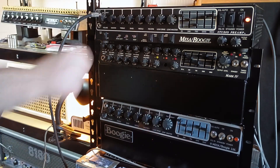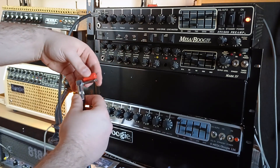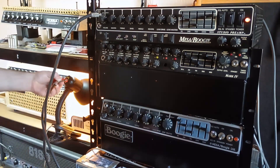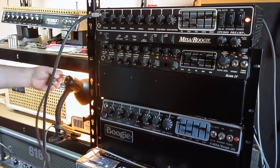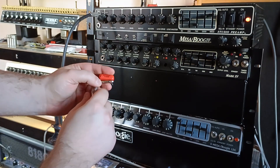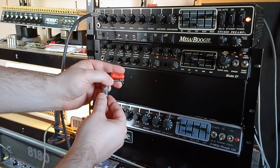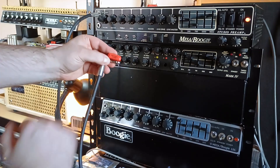Now I'm going to lower the volume again and flip the capacitor the other way around so we can compare the two sides, then raise the volume back up again. I'm getting less noise coming through the amp, so that means the capacitor lead that is connecting to the ground of the jack — the sleeve — is the one that I need to mark.